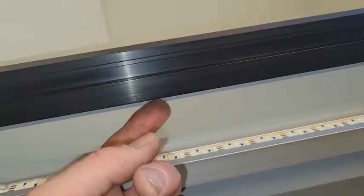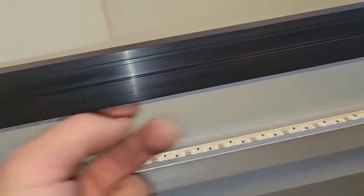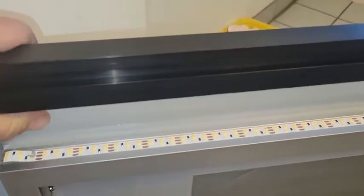So you've got to put the mirror and the bracket in between when you hook it up, so that the bracket rests up against here. And you'll feel a groove down here inside. It should hook up in that groove. And then the top of your frame will be flush with the wall. That way you've got it set up right.